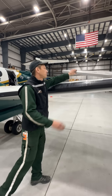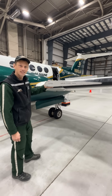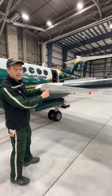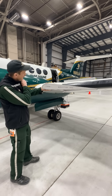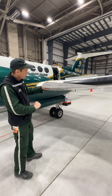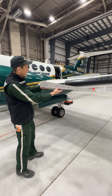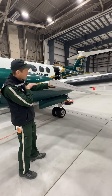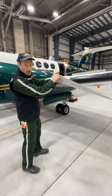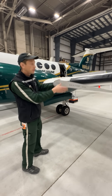I'll give you a little example of our wing shape. If you were to slice this wing with a cheese slicer, you would end up with a shape like this. This is an airfoil, and you can see the boot-protected area right here. This is a clean version of our wing. As impact ice strikes the front of this wing, it tends to accumulate in this area. This is a problem because when the aircraft slows for landing approach and this airfoil tips with respect to the relative wind — that's the wind striking the wing — you can get airflow separation here. That's called an aerodynamic stall, so that's a bad thing. We prevent that by breaking off this ice.